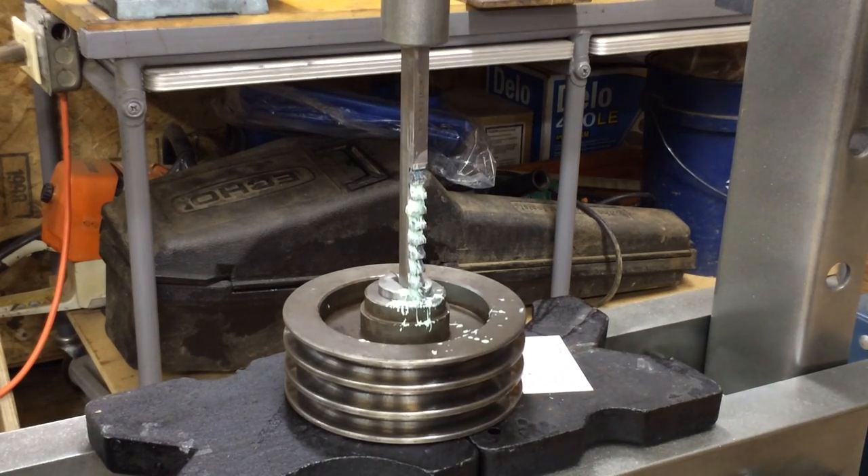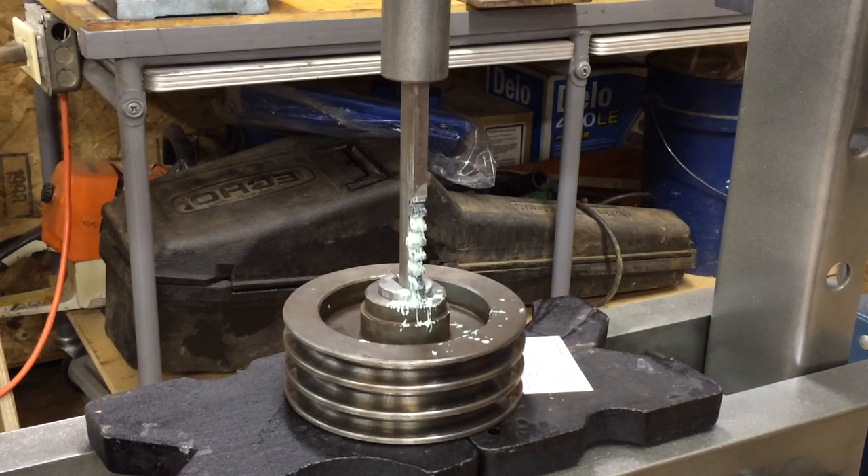Normally this side shaft has a quarter-inch keyway, but even that 8 millimeters is larger than a quarter inch keyway, so going to 3/8 isn't going to hurt anything.